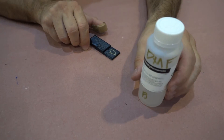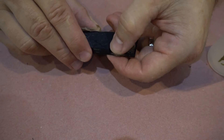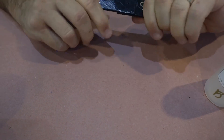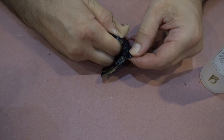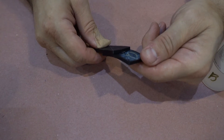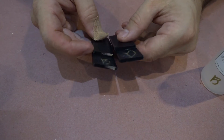Let's try straight DMF. This one seems like there could be a slight shadow of a haze, or it's simply that it shined the plastic a little where the solvent ate it away. In shear, very very strong. In peel, pretty darn strong — I seem to be able to get under it, but no, I can't. I'd put this right on par with the strength of the THF. Comparing the two, THF had very little staining and DMF has slightly more, but it's not accurate enough of a test sample to be certain. So far, THF and DMF are really successful.